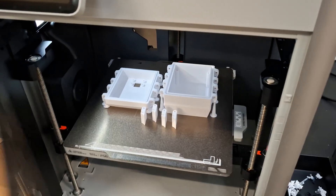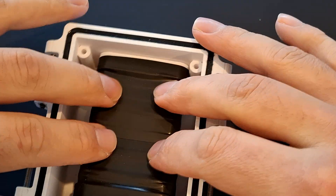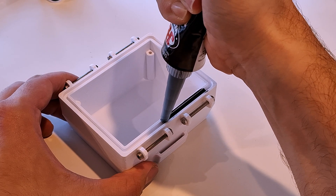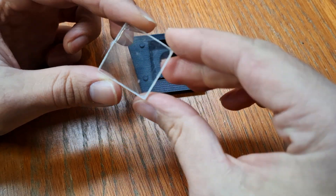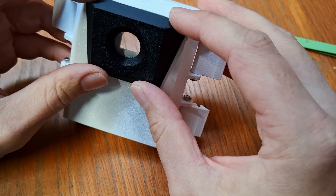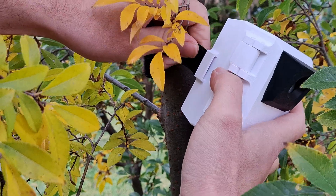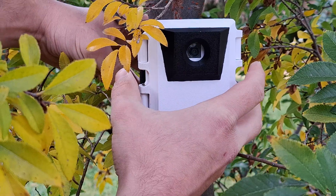To house the whole thing I custom designed and 3D printed this enclosure, which has clip hinges so you can open and close it very easily, and it houses the battery, Raspberry Pi, and camera. To ensure it's watertight I used liquid gasket to create a seal, and a little groove in the lid compresses onto that. It also has a separate shroud on the front that you can 3D print and glue in place, which houses a small acrylic viewport for the camera, making the whole thing waterproof. On the back there are slots to insert a velcro strap so you can mount it onto a tree or pole. I'll make the STL files for this enclosure available online — the link will be in the description.